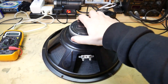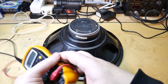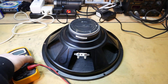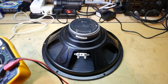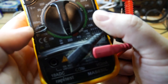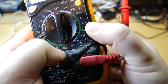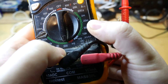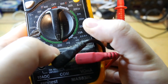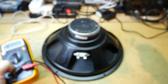So the second thing to do is to check the resistance. The best way to do that is to set your multimeter to ohms — anything that will get you single digits, or double digits really. On this one here it's set to 200, so that's perfect.